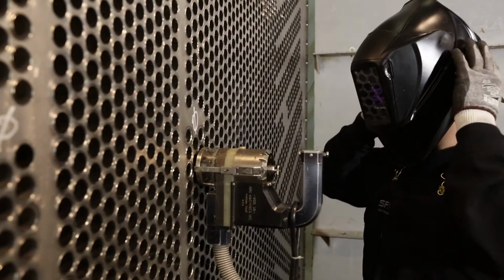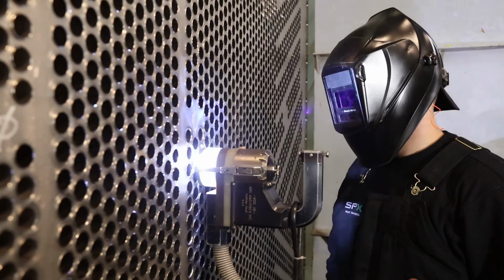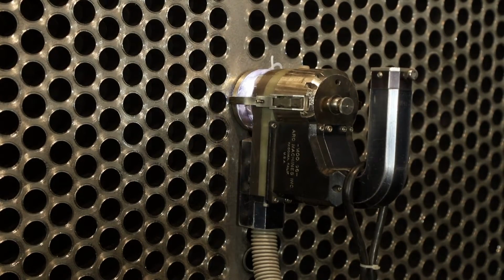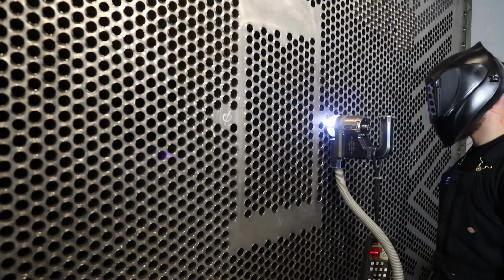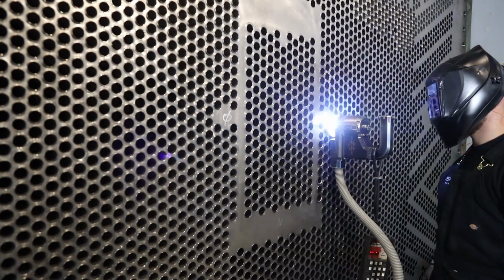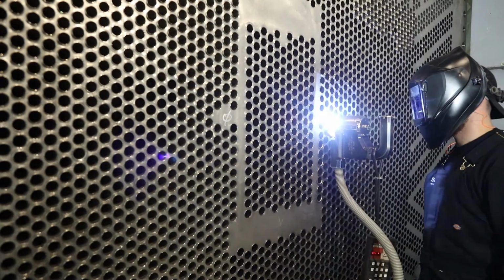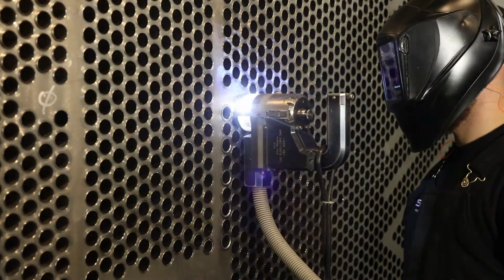It is important to provide a properly deposited single-pass seal weld using the gas tungsten arc welding process, also known as tungsten inert gas welding. This fusion welding process uses no filler. Each tube is carefully welded to the tube sheet to provide a strong, leak-tight system. SPX heat transfer uses a fully automatic fusion process for tube-to-tube sheet welding.